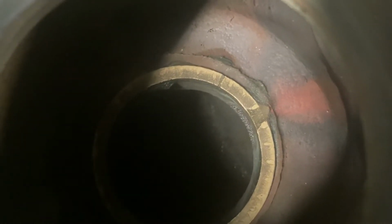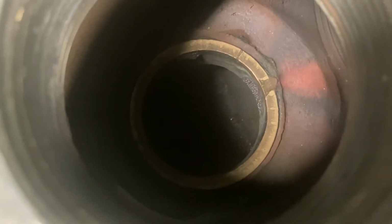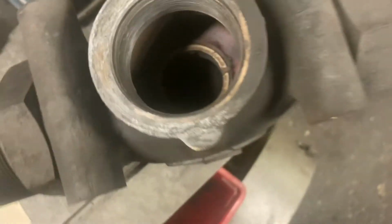The valve head's actually stainless steel. And so what happens is, it gradually, due to the sheer kinetic energy of that stream of gas or liquid, but also any scale or rust or dirt or grit or whatever it's carrying through it, acts a bit like a water jet cutter. And so it simply cuts through the bronze. And the only way to cure it is you've got to machine that step out. You've got to remove metal from the rest of the seat so that it's level once more, and then hopefully it should last a wee bit longer. So now that's a little job that came in.